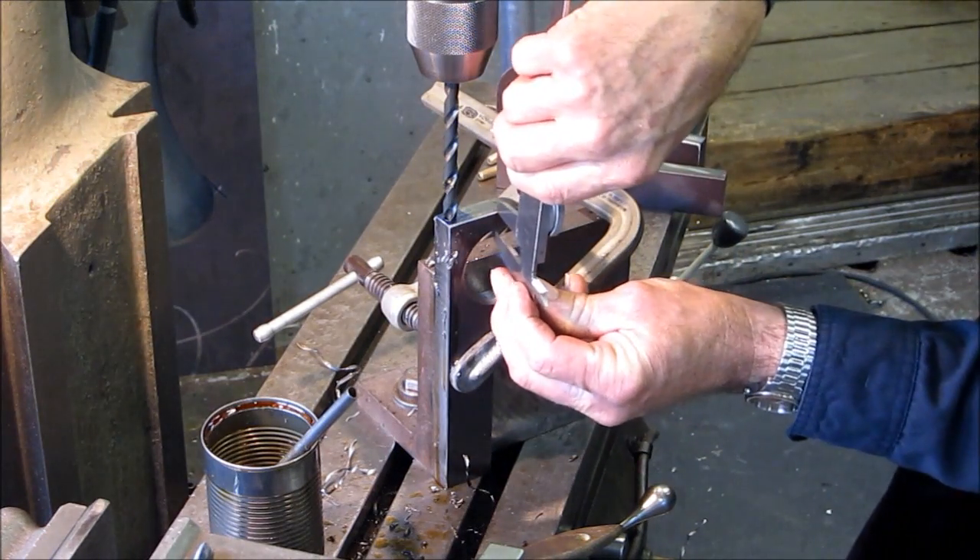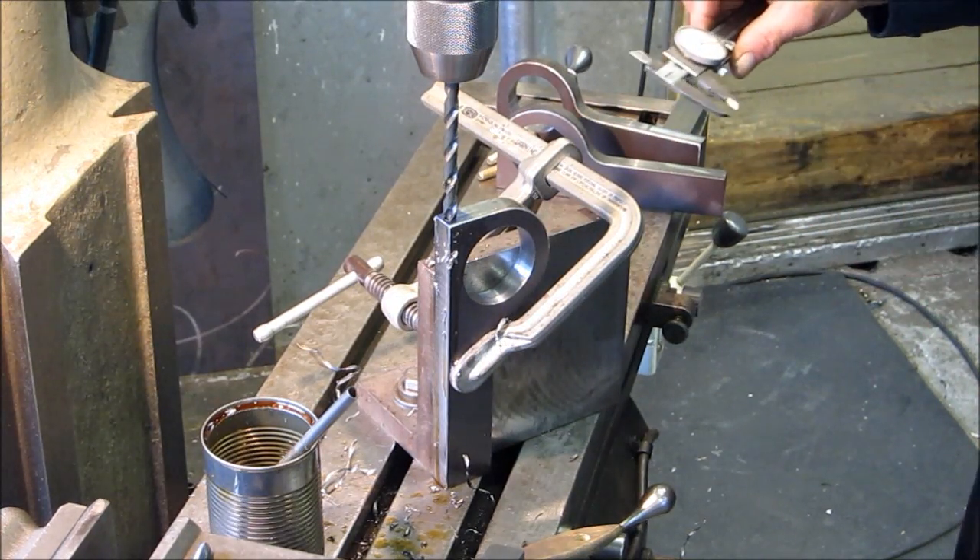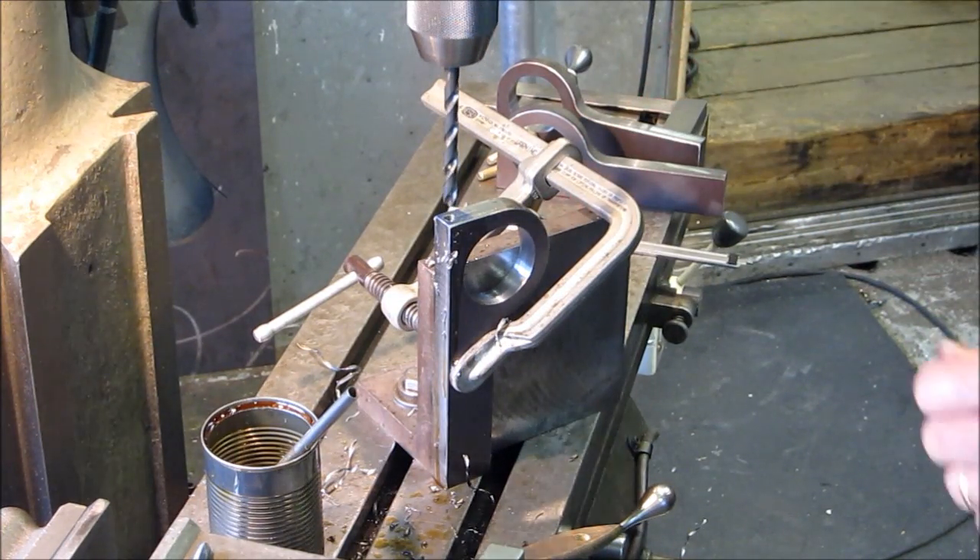The reason I cup with my hand is the windows here are filthy, so I just cup them. I'm pretty well calloused, but you're right — if you're blowing air and cupping your hand you could blow a chip into it. We're going to be drilling down about two and a quarter inches. Now we just want a clearance drill — we'll drill down to the split line. Going to give a 64th clearance over the five-sixteenths. We set zero so we don't go too far; we'll figure about an inch and a half.